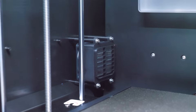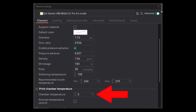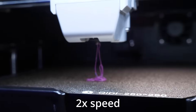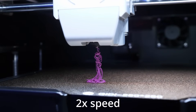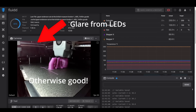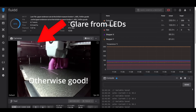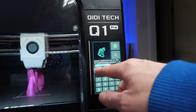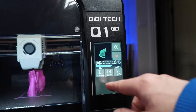The chamber heater should be a great benefit, but it doesn't do anything by default because it hasn't been set up properly. When set manually on the web interface it does work pretty well — with the heated bed at 100°C and the chamber set to 60°C, it reaches that temperature in around 16 minutes, which is quite impressive. The filament unload button just tells you to cut it and then purges for ages, which seems wasteful when a retraction would do. The camera works, although the lighting has no baffles or diffusion, which really poorly affects the visual quality. Lastly, the touchscreen is resistive rather than capacitive and not very intuitive — not exactly a premium or pro experience.